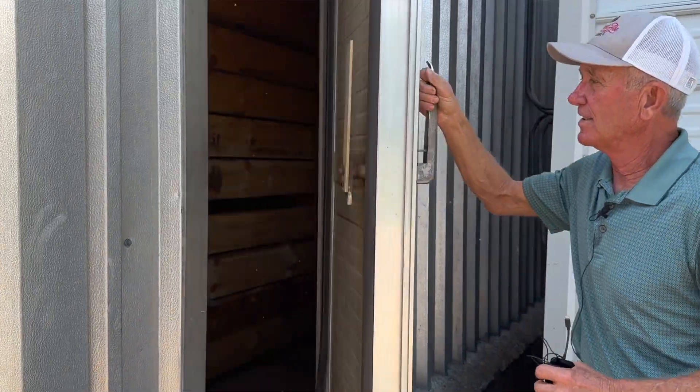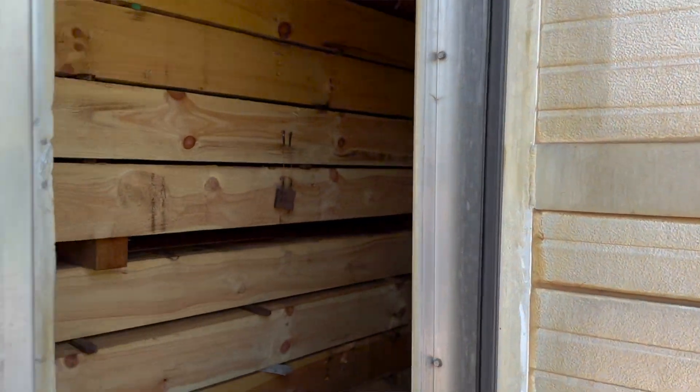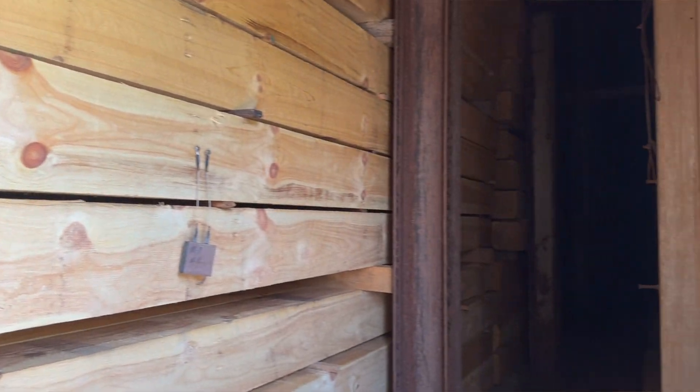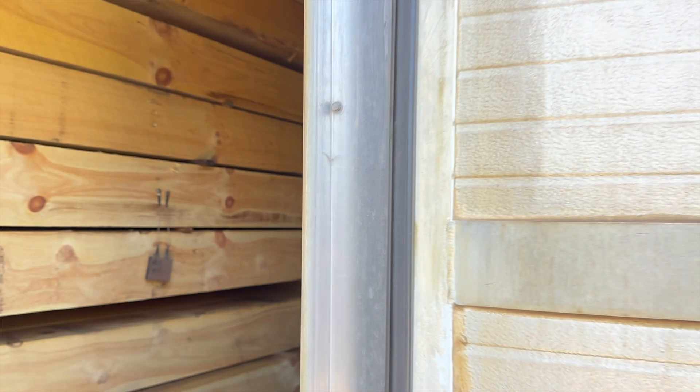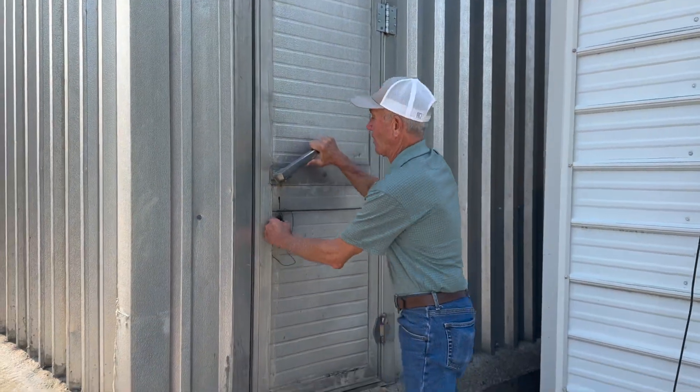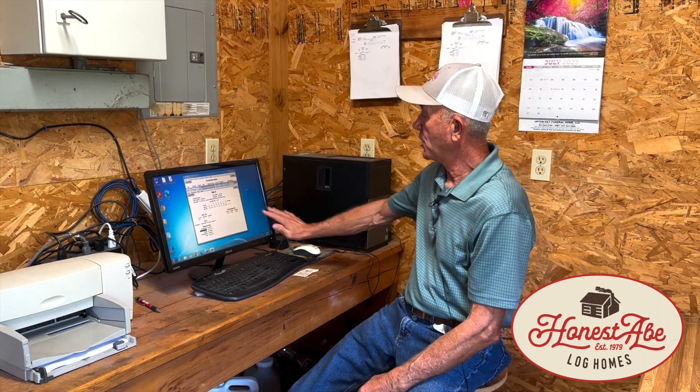What you've just seen is the boiler. That's how the sawdust comes in — it goes into the firebox. You've seen the firebox where it heats up, that gets the water really hot, and then it sends the steam into the dry kiln. When you saw the door opening, the heat was coming out. The fans run three hours one way, then three hours the other way — that drives heat evenly to each side of the logs.